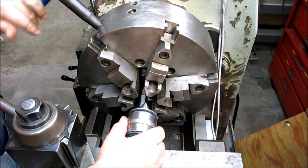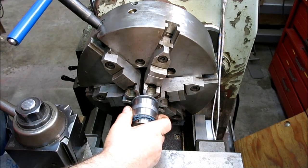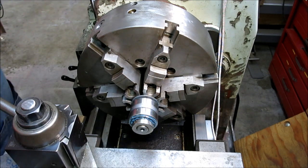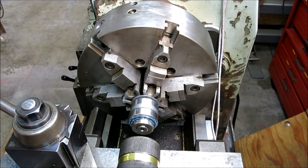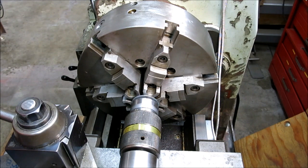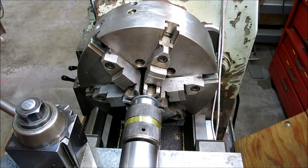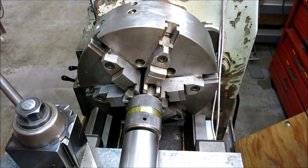How am I going to press this back together? Well, why don't we just stick it in the lathe and use this to hold this thing just lightly — that holds it on center. Then a clever guy would just put the other bit in the tailstock and push them together. That's the theory anyway. There it goes — that's working pretty good. I'll have to put a little spacer behind there.